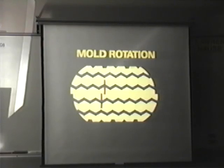But the molds, the top and bottom half of the mold, okay, the mold can have the outside edge of the design up here and the inside edge of the design here. The mold closes, the tire's inside, vulcanizes, and it opens and the tire comes out. That's called a clamshell or a full circle mold. It has two halves and opens and closes like a clamshell. That mold can get offset, twisted, one way or the other by about a tenth of an inch. And then when it gets more than that, they usually take the mold out of production for a little while and adjust it and get it back to zero.